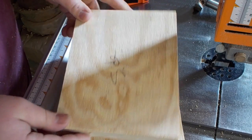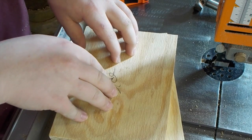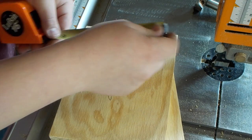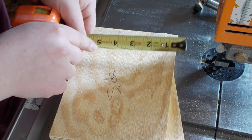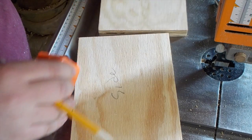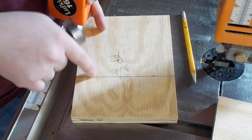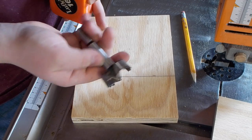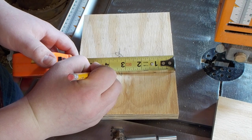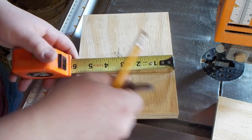These are the two side pieces for the box and I need a cutout here so that they can slip over the centers of my lathe. That mini lathe is a 10-inch swing capacity, so dead center — I measured it — is 5 and an eighth inches. So I have to mark about 5 and an eighth up from the end of each board. I'll extend that with a speed square. Now I'm going to drill out the inside corner of the cutout with an inch and five-eighths Forstner bit, and I think I'm going to bring this cutout back to about four and three-eighths.